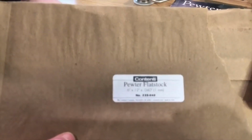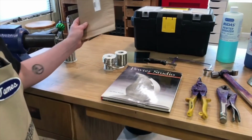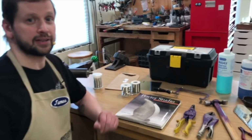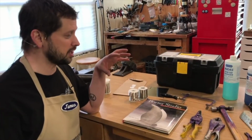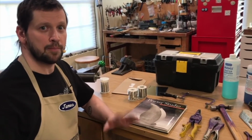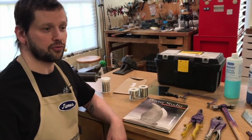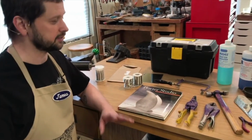And as you're getting set up in the studio, particularly if it's a jewelry or metalworking studio where you do higher temperature silver soldering, the most crucial aspect is for you to keep everything completely separate. Pewter is predominantly a tin alloy and has a much lower melting and soldering temperature than silver solder used for non-ferrous metals like copper, silver, gold, things like that.